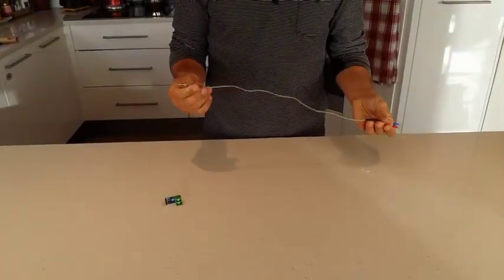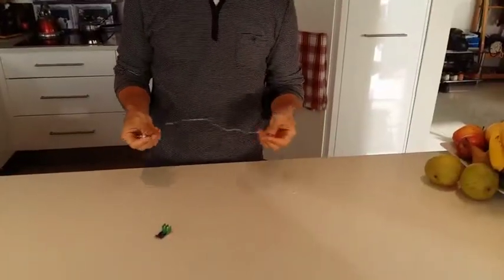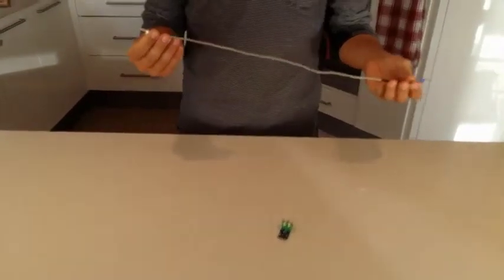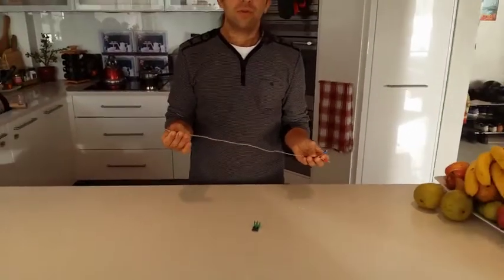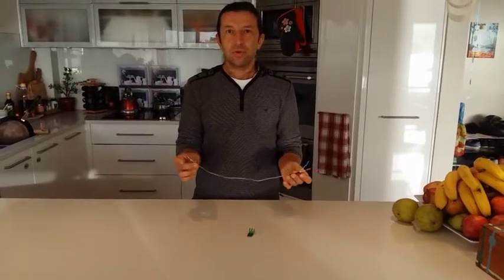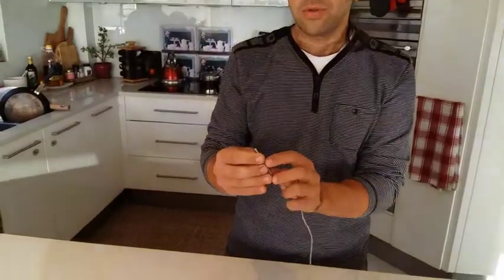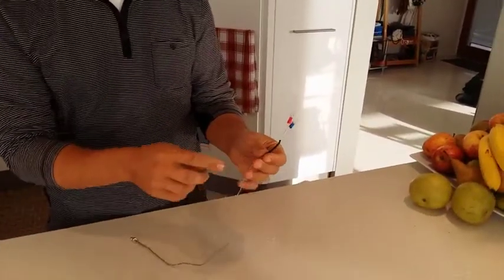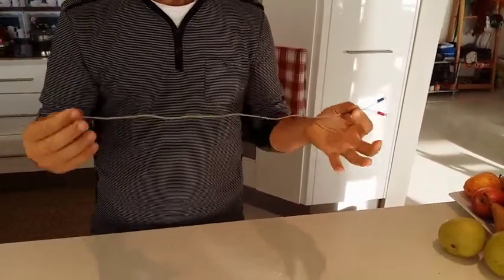So let's start with this one. As you can see, this is the tip that measures the temperature, and this is the end that connects to the board. It comes already assembled, so you just have to stick it into the board and stick the board into the Arduino. However, you want to be careful about what the thermocouple actually measures. Contrary to my first understanding, it doesn't measure an absolute temperature — what it does is measure a difference in temperature between two junctions. One junction is the hot junction, which is the junction of two different metals. The other is called the cold junction. So it's important because the thermocouple measures the difference in temperatures between these two points.